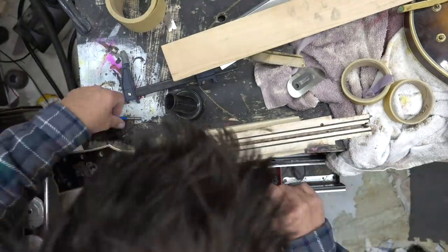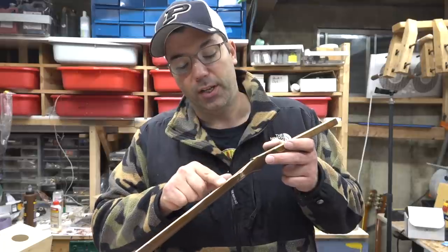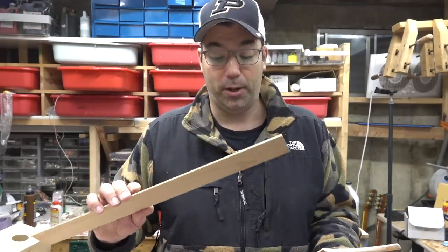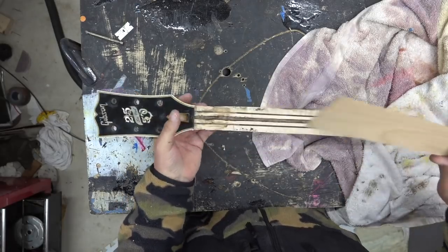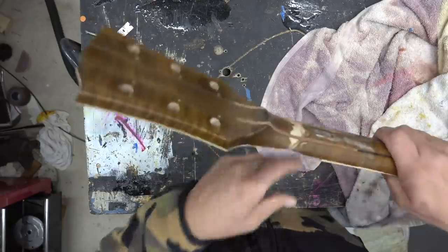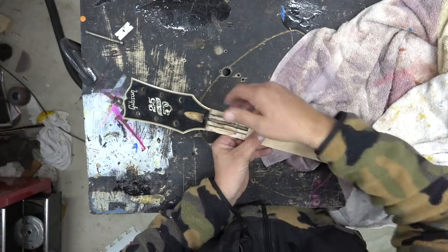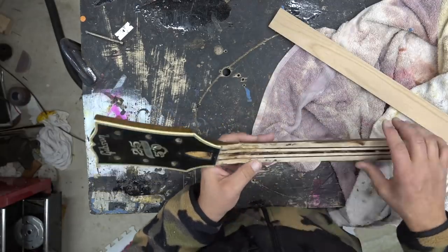The trickiest part now is going to be replacing the wood on the front. There was some hot glue used for some reason to fix this. What I did is cut an eighth-inch strip of alder — you can see how much is missing off that front. What I'm going to do is double-stick tape a strip here, push this over a router, take this piece out, and then glue in a new eighth-inch front plate that is going to give us some strength back. I'm going to use flame maple because I've got a couple good pieces laying around.